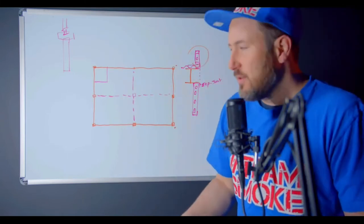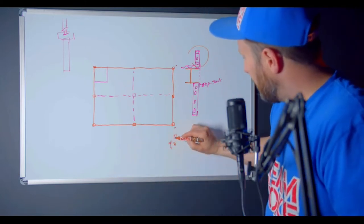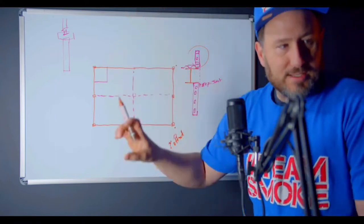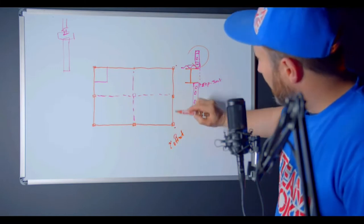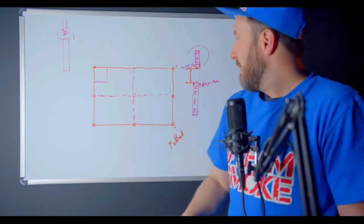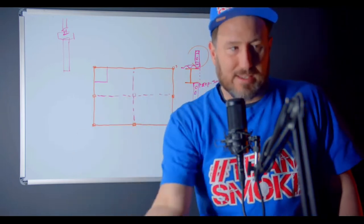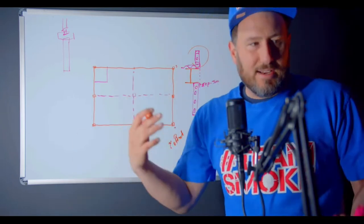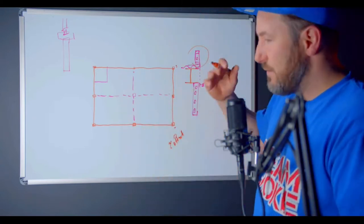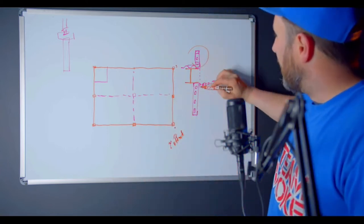You set up your rotating laser somewhere over here with a 2-inch offset. That way you can take the reader and just check the points. You want to check the top in the far corner, and make sure that the steel is going to pass. You can go flush, or bring it out, but don't put the steel on the inside. So no matter what, just change your layout lines so that everything works. You don't have to build anything out. It has to work on the outside of the building.